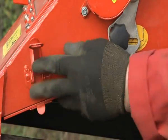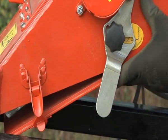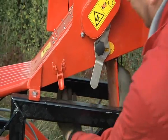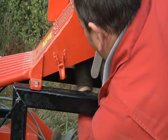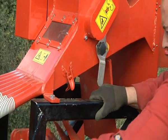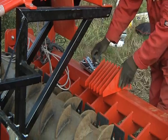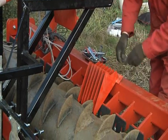Changing seed rollers takes just a short time. First, release the hatch below the seed delivery channel. This is the same hatch to be opened in order to calibrate the seeder unit. Remove the seed direction baffles by pulling them in a downward motion to allow complete access to the seed rollers.